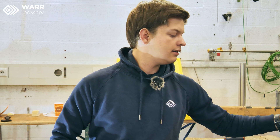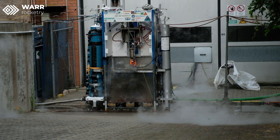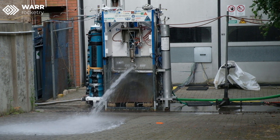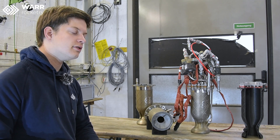After that, we go into commissioning testing of the full engine assembly. We attach the injector and go into cold flows to determine correlations between mass flow and pressure drop, because we can't fly mass flow meters on a rocket — they're simply too heavy. We determine the load points, so the settings we need to adjust on our test rig to get the target mass flow, and also characterize the injector. After that, we go into dummy runs, which is basically a cold flow with both sides at the same time, but using LN2 instead of LOX since we don't ignite — to get all the procedures down and verify our test article and test setup.